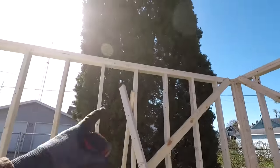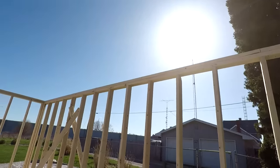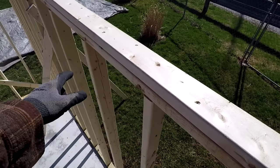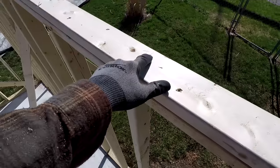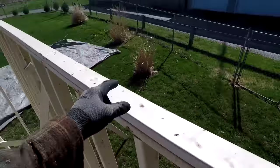And then gable walls, just need to transfer the stud layout up, because then gable studs will go all the way up, closing the gable. Still got beautiful weather, no wind yet, so I'm gonna keep banging away on this thing. I'm gonna show you how I mark gable studs. I mark the long points, so now I know how to measure. There's a center that's going to come right up underneath my ridge, because that's 12 feet of a 24-foot wall.